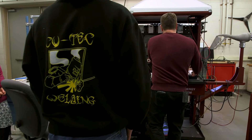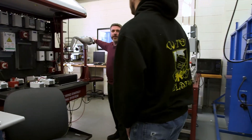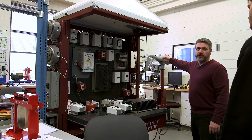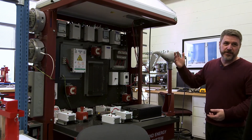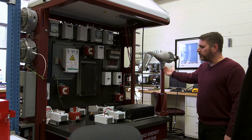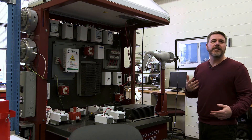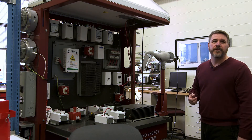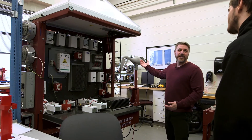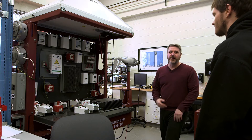This is our small wind and solar trainer. We have a small wind turbine hooked up to a motor. This generates what we call wild AC — the frequency changes depending on how fast the wind is going. We have to rectify that, meaning turn it into DC, and then we have an inverter that takes that DC and makes AC that matches the grid. The grid frequency has to be 60 hertz, so we convert it to DC in order to reconvert it into 60-hertz AC.